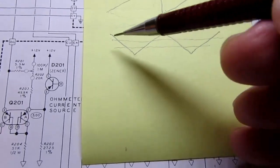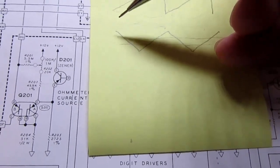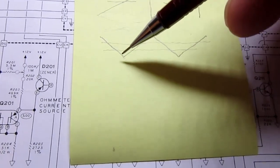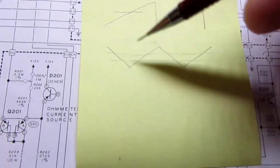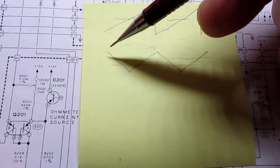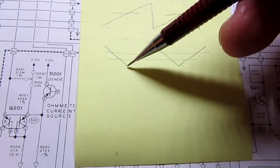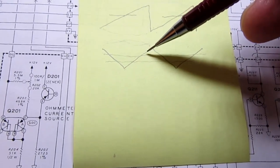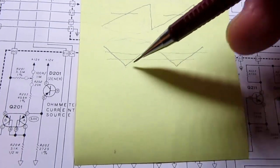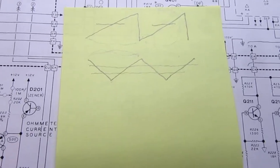So during a cycle you get two slopes instead of one. The slope in this case, where it's going down, you can treat that as like the calibration. It's using all the same component values that are used to integrate up, but this time it's just being used to set an internal reference. And then when it goes back up, that reference compensates for any changes in the slope on the way up. That's an oversimplification, but that's basically what's happening.